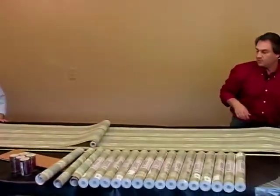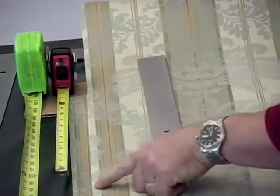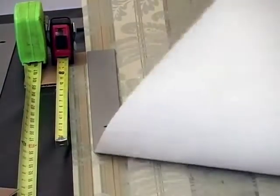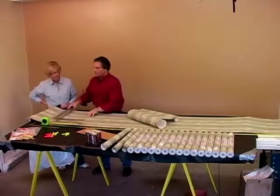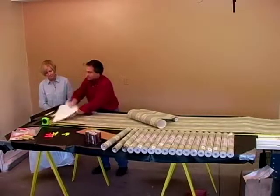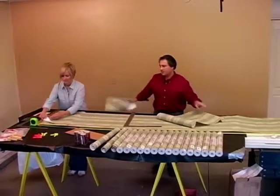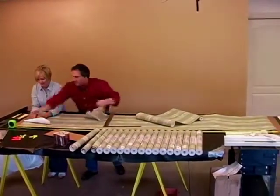Now, I'm going to show you a couple of little techniques here. This is going to make a big difference. We're going to measure down 14 inches. We set it here. Now, remember, we already added our 2 inches in, right? So there's our 12A. Now we need to turn over our carpenter's square and cut this, and we mark it what? 12A. 12A, that's correct. Very cool. That's great. Now you're starting to think like a wizard. Now you always mark the upper top.